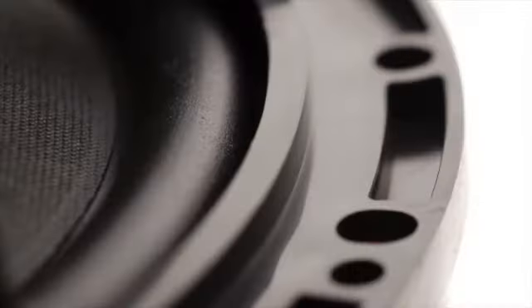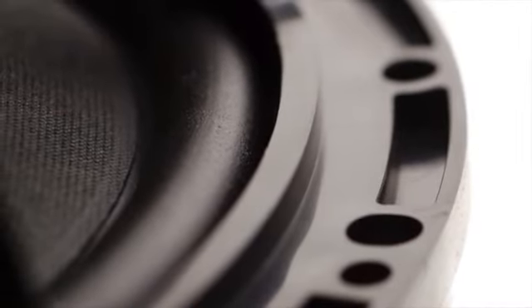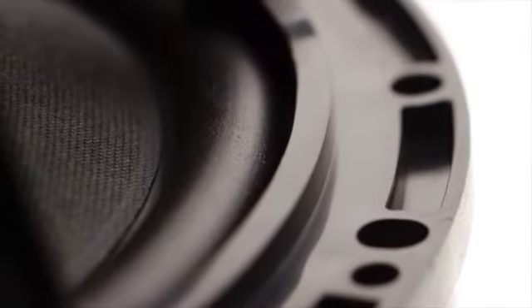The frame is a high-quality cast ABS design, proprietarily tooled by Hybrid Audio, which plays a critical role in aligning the voice coil in the magnetic circuit. It allows for the inverted mounting of the high-loss rubber surround to optimize edge mode damping and for shallow grill clearance, an exclusive feature to all Hybrid Audio products.